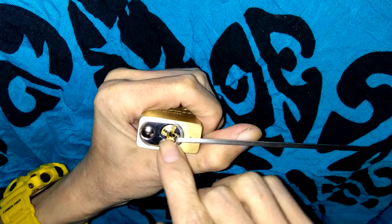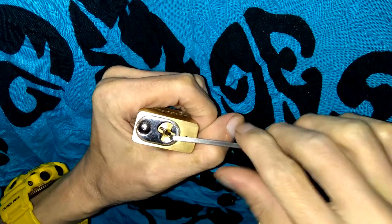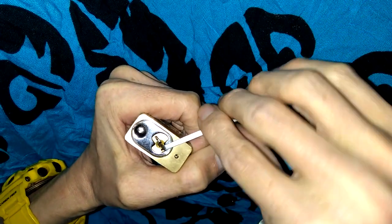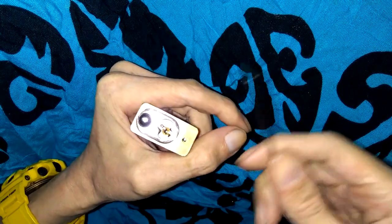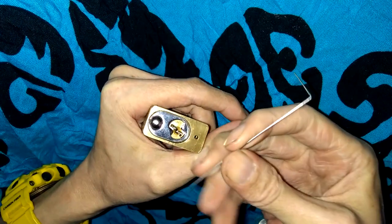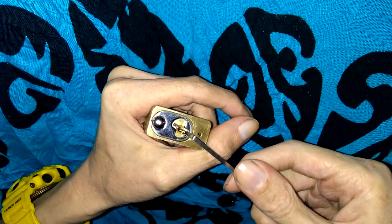And that takes away from your plug, so you can't really put tension on the plug, can't transfer the tension to the key pins and driver pins. So there's a couple different solutions to this. Some people say put a paper clip in there. I don't like doing that. Some of the Southord kits come with this. It's an 18 thousandths bottom of the keyway tension wrench.